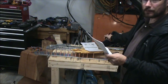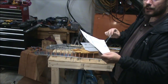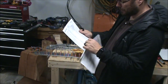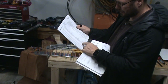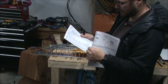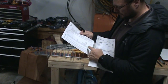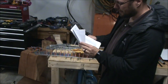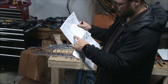And then when you get to the horizontal stabilizer, same thing. It's real easy to go through here and find HS. And then from there, you just look and see. Usually they're in sets. And you can just go looking at the end numbers at that point and go like, hey, here, the part I need is in subkit 8. And if you sorted it out like I did and labeled each subkit, you're going to spend maybe 45 seconds to 60 seconds looking for a part most of the time. Don't underestimate organizing that way. And keep your parts organized, and it makes it go a lot faster.